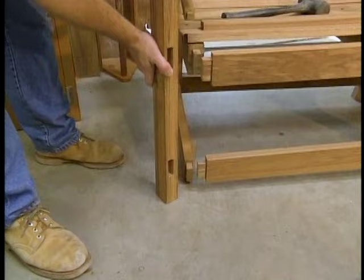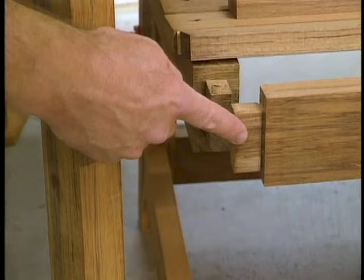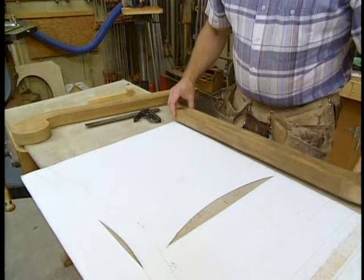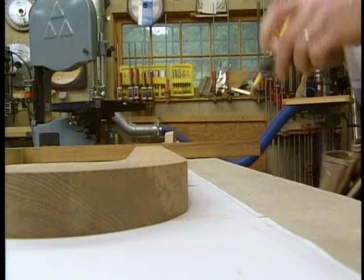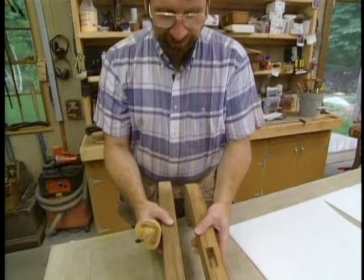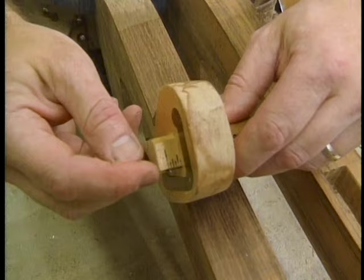I've carefully removed one of the front legs to show you the mortises. At the bottom there's a front stretcher and a side stretcher, so I need one mortise here and one on the back side. At the top there's a rail and a seat support, so there's a mortise on the edge and also on the back. To lay out the mortises this is where my full-size pattern comes in real handy. I take the blank that I made, align it at the bottom, and then using a combination square I can transfer the marks for the mortises. To mark the sides of each mortise I'm going to use this marking gauge. It has a scale on it and a guide, and the first setting I want is five-sixteenths of an inch. There's a steel pin with a very sharp point that scores a mark in the wood.